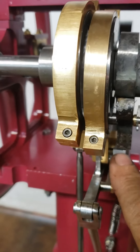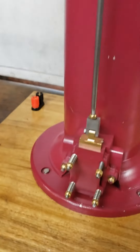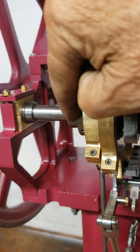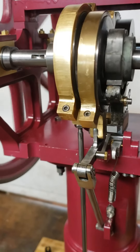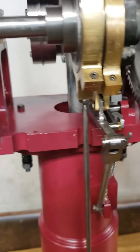Some of the other things going on: here's the slide valve — as you can see, it's being operated by its own eccentric right here. This is the lift eccentric, this is the valve eccentric. The two are 90 degrees apart, and that's kind of the magic of this mechanism.